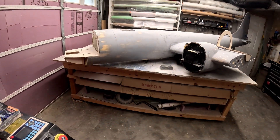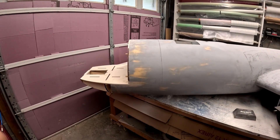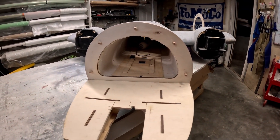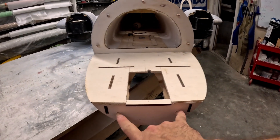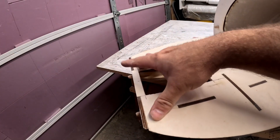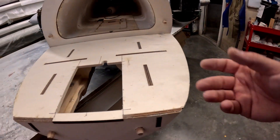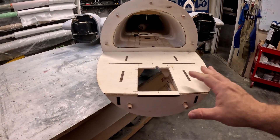The airplane no longer has landing gear on it — I went ahead and pulled those off because it's easier to work on the nose section and sand things without it wanting to roll everywhere, especially since it just barely fits on this table. Yesterday, after laying up the carbon fiber, I came in and drilled the holes for the three-eighths inch retention dowels — there are five here and two up at the front. The two at the front actually go into the maple and plywood retract rail, which helps pin it in place and prevents forces from ripping the front of that rail off. I still need to get in with some tri-stock in a couple of areas, but it's more or less structurally sound as-is.